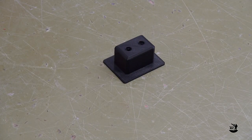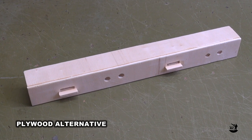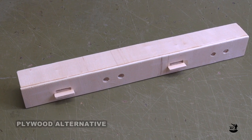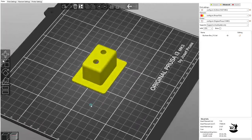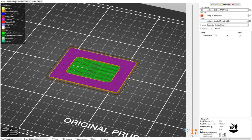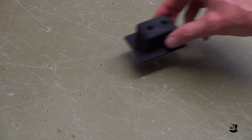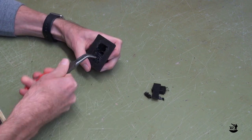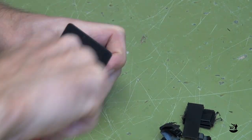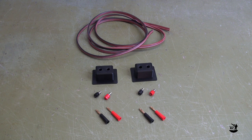For the next steps you will need a 3D printer. But don't worry if you don't have one — I will also show you an alternative made of plywood right after the installation of the 3D printed consoles. Now heat up your 3D printer and print the charging console. The link to the free STL files is in the description below. You will need to activate supports for this print. Use a pair of pliers to remove the supports before continuing. We will need two consoles, four banana plugs (red and black), four banana jacks (also red and black), and a silicone wire.